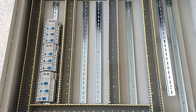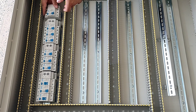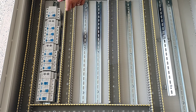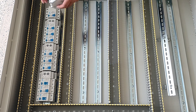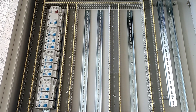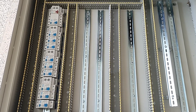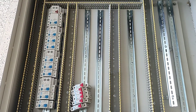For three-phase outputs, we use a three-phase RCCB switch and a three-phase monitoring relay next to it to protect the outputs from phase loss. For each single-phase output, we use one miniature switch and connect both miniature switches to one RCCB switch. Therefore, we need 18 miniature switches for these RCCB switches.